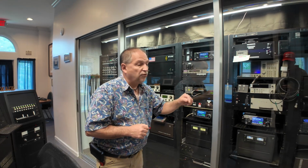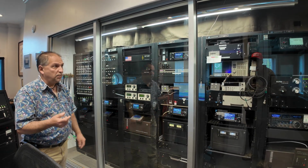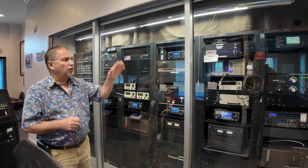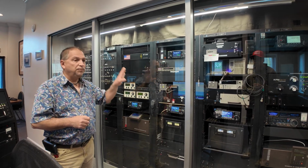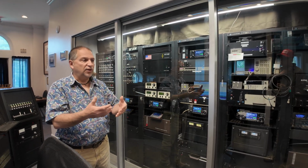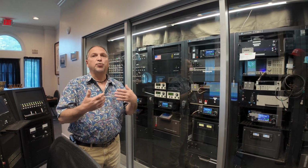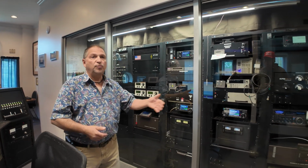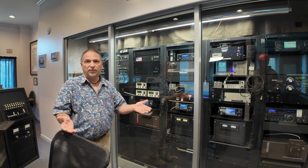Again, right now we're starting off the preamble to our fast code practice. We run anywhere from 800 to 1,000 watts depending upon the band. With the exception of 160 and 80 meters, on all the other bands I am running high gain antennas, monobanders with appreciable gain. So my 800 watts in many instances may give me 3,200 watts effective, ERP.